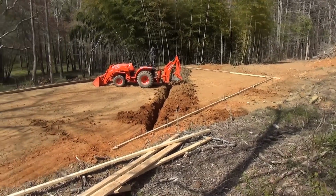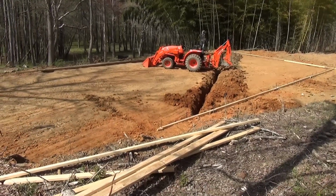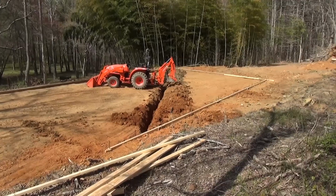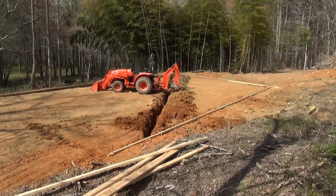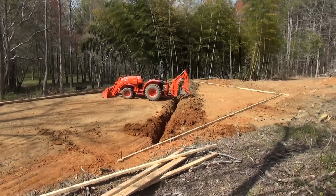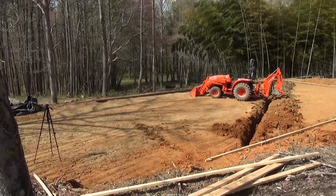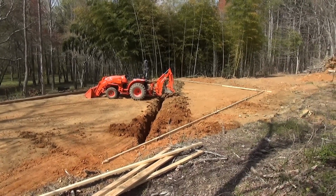They'd forgotten that I was putting a water line that would go to the back corner, come out to this corner, and then feed off up toward the pool house to be tapped off so I'd have water in the shop. So I had to start trenching here to get that water line in, and now they're a little worried that I won't get it covered up and done before tomorrow, when we hope to finish digging the footings and the pier holes and get the concrete poured.